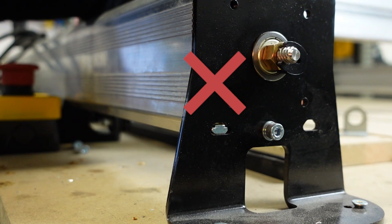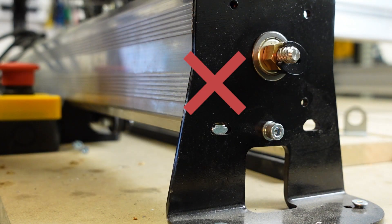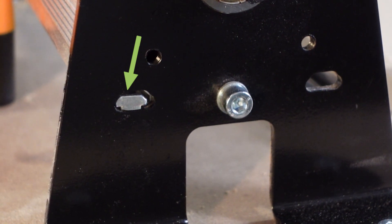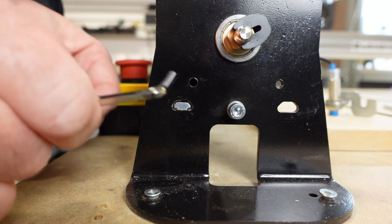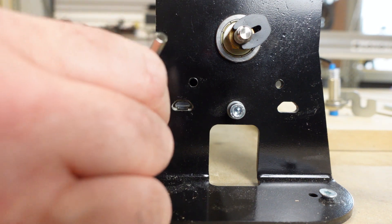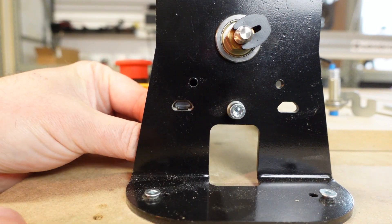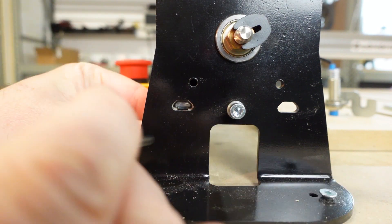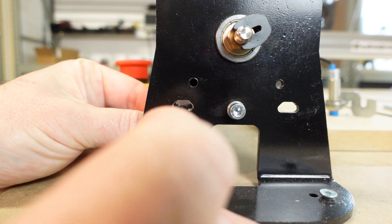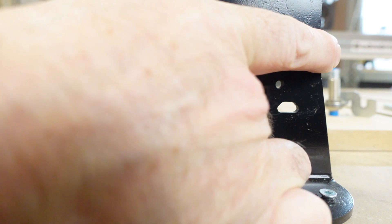Take the small extrusion nut and slide it through the small opening on the front of the foot as shown. Here you can see my mistake — I put the nut upside down. Flip it over and carry on with the rest of the installation. Using the small allen key, push the nut into the rail but not too far. Get the small socket head bolt and prepare for the tricky bit — you'll want to thread the bolt onto the nut. I'm looking through the hole we placed the nut into as I found it easier to thread the bolt on. This could take a few minutes but you'll get it.